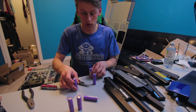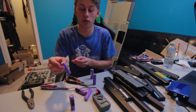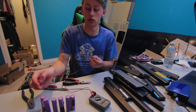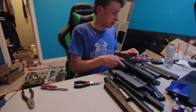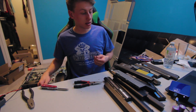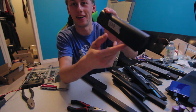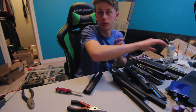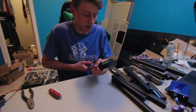These six cells don't look like Samsung but they're still cells, so let's test them: 3.75, 3.74, 3.74 — they all read around 3.74 volts. That means they still have some charge. They passed test number one, but I'll have to test the capacity — that's the real test. For the next pack marked bad, I'll open it and see. Pliers are recommended.